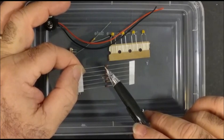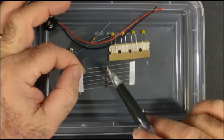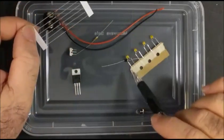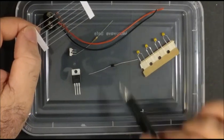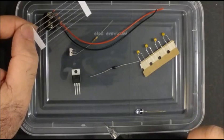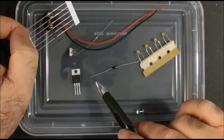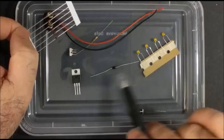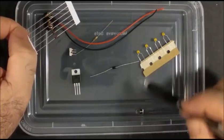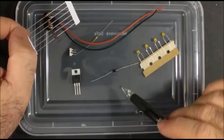So this stripe here is actually going to go to the positive side. If you hook these up backwards, they'll conduct like a regular diode. This device conducts in one direction — a diode works as a one-way device and current only flows one way. When you go the other way, nothing happens. No electricity flows through; the electrons just stop.